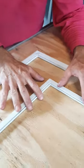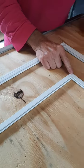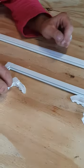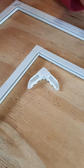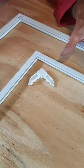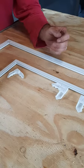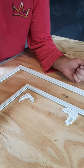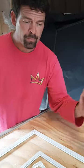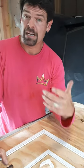Right now you see a kit down at your local hardware store that is three-quarter inch frame with the plastic exterior corner. This makes it very easy, very flawless to build you a screen. However, as a manufacturer, I will tell you three-quarter inch is not the proper frame to use for solar screen, because solar screen is very heavy. It would tend to hourglass or begin to sink or stretch itself out after a few years, if not quicker.